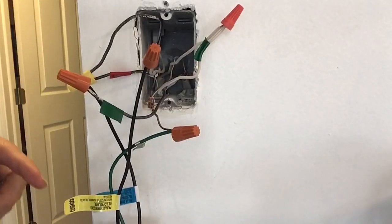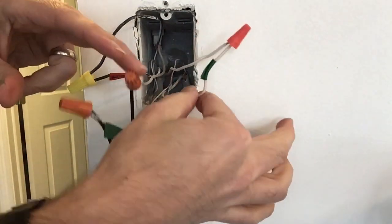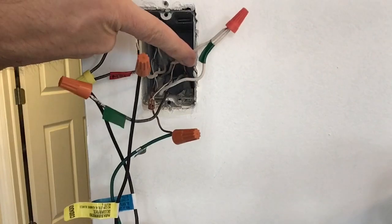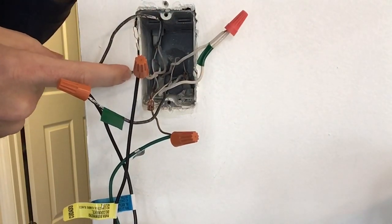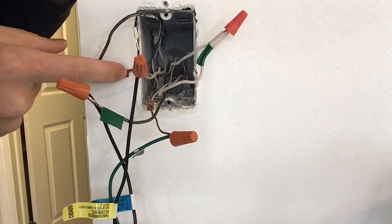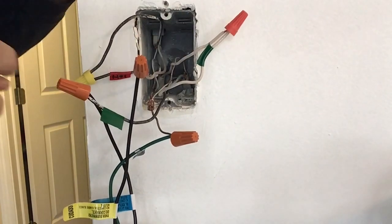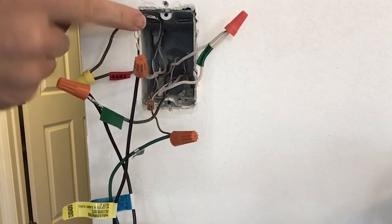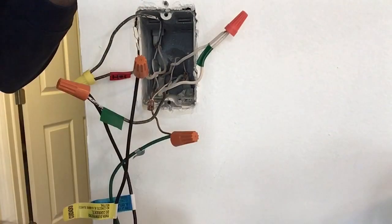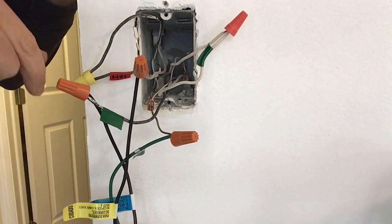The white-green comes back up to the top of the stairs, and then the power goes down the white lead paired with the live red-black wire. So in the four-way setup: power goes up to the light, comes down to the first switch, goes down to the second switch, over to the third switch, and then comes back down the wall. It took a few steps to figure this out.